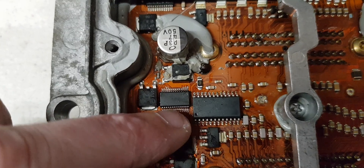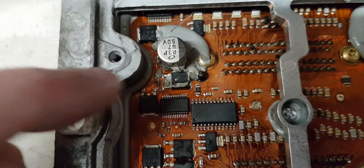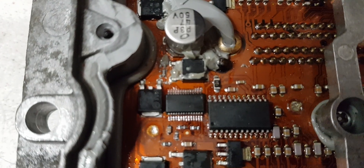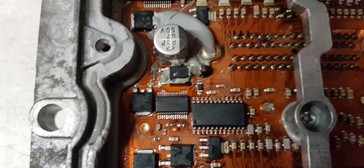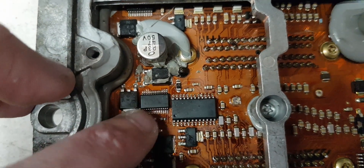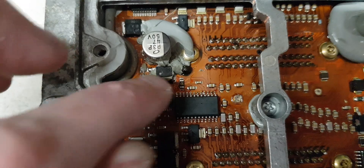Removing them is quite hard as well, so I'd suggest putting plenty of flux on and just running a bead of solder either side, and using the hot air gun to bring it up to temperature — it should just slide off the board. Similar to putting it back on as well; I'd just preheat the board slightly with the hot air gun, and that should help you flow in the pins.